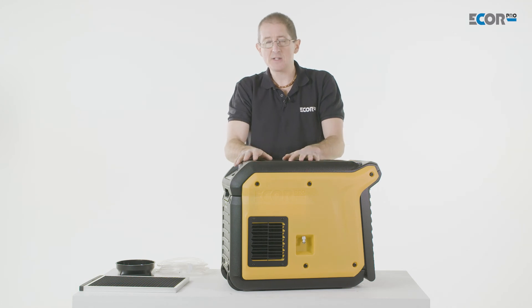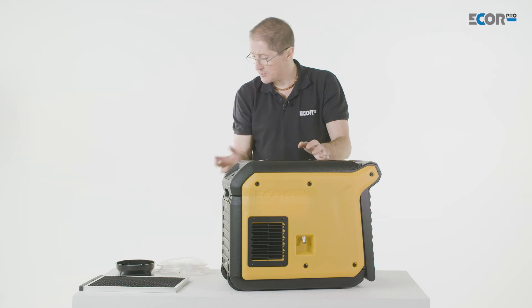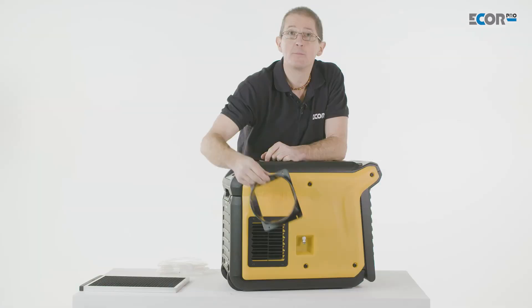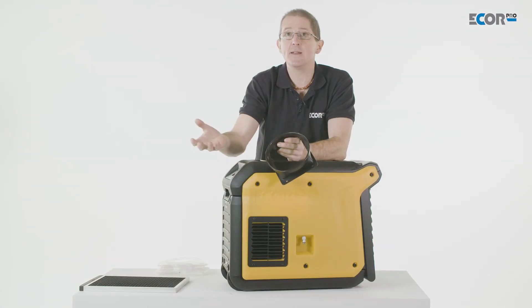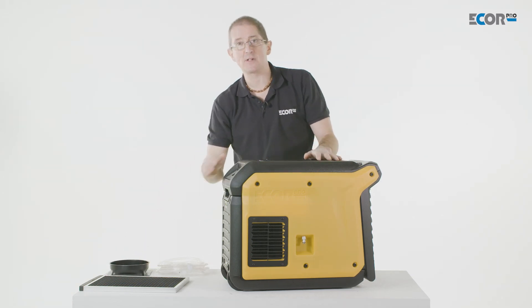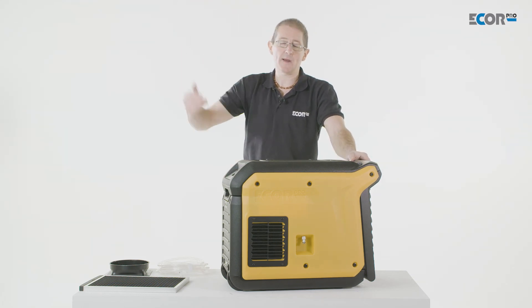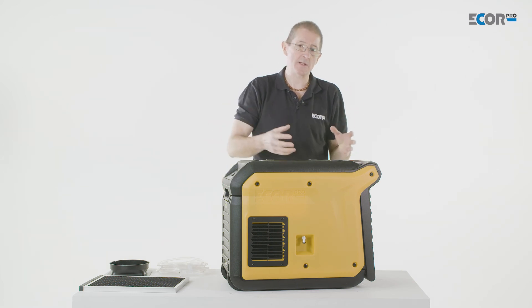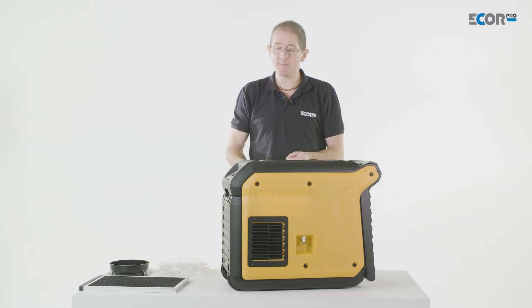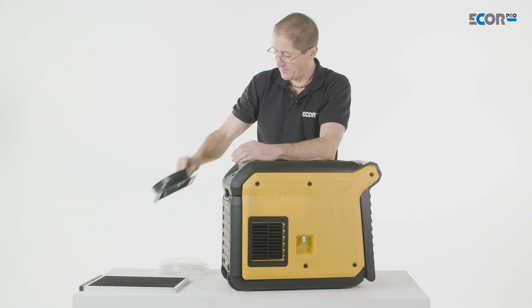If we want to work the machine separately from the drying environment, or if the drying environment is small — for example a tented enclosure — it's straightforward. We can put a duct adapter onto the air vent and duct that dry air into the tent, giving us a focused drying regime. That increases efficiency, because leaving it in the middle of a room means it has to dry a large airspace first, which is a waste of energy. In our energy-conscious world, that's not acceptable — all dehumidifiers really should work with ducting and a focused drying regime.